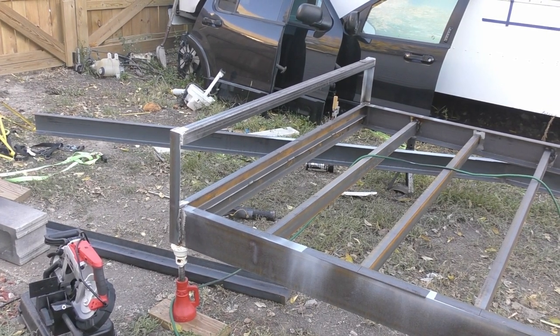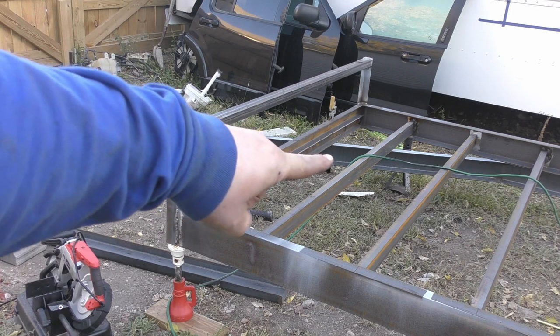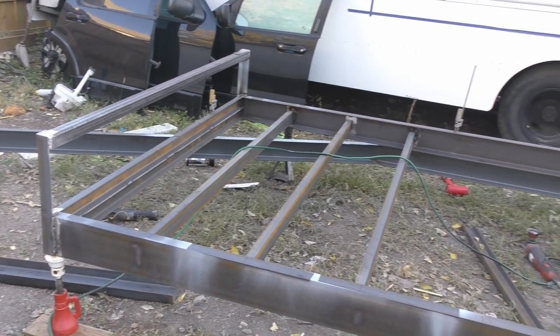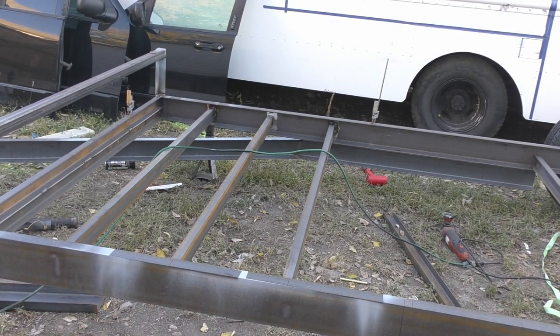All right, so I got the main piece of the tongue on there. It ended up a little longer on this side than I was kind of expecting, but it's not exactly exact science going on here. So I'll be able to run a couple seams of weld around here, across there, and then where the two halves of the C-channel kind of come together, we'll be able to zap along there. So that's looking pretty good. Now just have to grab the grinder, hit a couple of things, get the scale off of it so I can zap it in good.